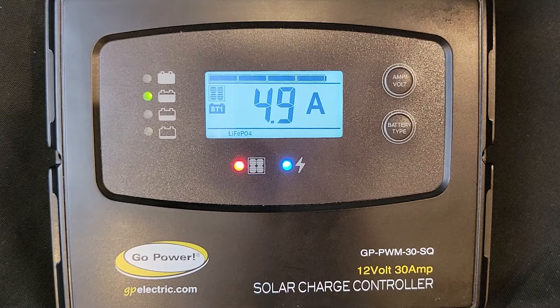This bar will flash when the battery is being charged. The battery icon on the LCD screen indicates there is a proper connection between your controller and the battery. Above that, the solar icon indicates that the controller is connected properly to a solar array. The red solar panel indicator LED light indicates there is a charge coming from the panel into the battery, and this light could be solid or flashing depending on the charging state.